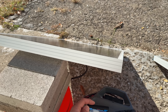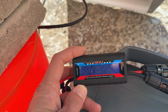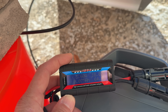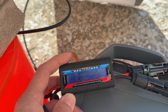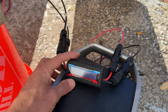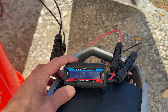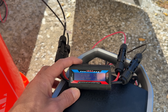We're plugged in on the Eco Worthy side and using power meters to get voltage and amperage, but also watt hours in the lower left corner — those will accumulate throughout the day and that's how we'll really compare. We can do spot checks on power, so we're right at about 65 watts, but accumulating energy throughout the day means any clouds or changing conditions will affect both panels equally. The Renogy is around 75 watts just before 10 a.m., so we're not at peak production yet.